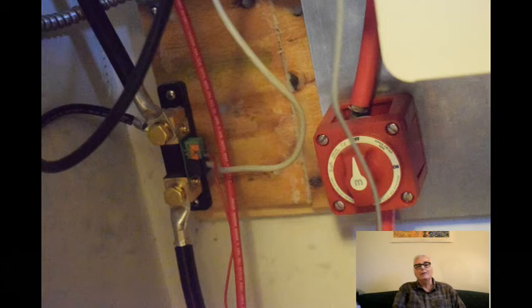To the right of the shunt you can see a battery switch. This is a battery switch rated at 48 volts. I've opted to go with a 24-volt nominal battery system — the actual operating voltage for a 24-volt system can come up to around 29 volts — so you need a switch rated for the operating voltage. This switch is in the positive wire from the batteries and allows me to disconnect the batteries from my loads. It's rated for a continuous load of 275 amps and an intermittent load of up to about 700 amps, and it's rated for 48 volts DC, well above my 24-volt nominal system.